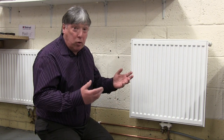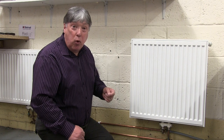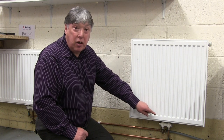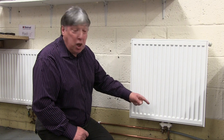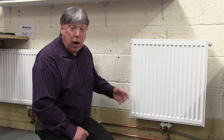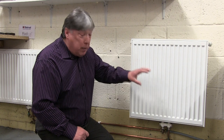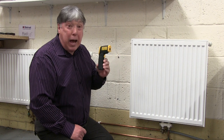All we're going to do is find the radiator that's overheating, cut it down a little bit on the lock shield side, and the radiator that's underperforming will naturally go up. If we find that the centre of a particular radiator is a little bit colder, that needs investigation. It could be sludge, or maybe the lock shield valve isn't quite fully open — we've had that many times. You turn it on but the valve is still half off. This is where a laser thermometer is absolutely brilliant.